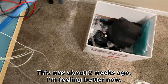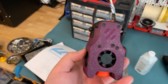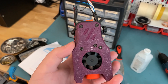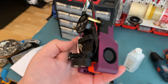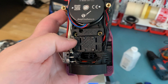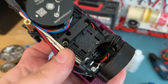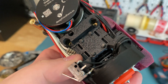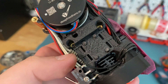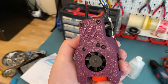I assembled the toolhead for the Micron. You can see the Voron logo here instead of the Micron logo — I'll get to why that is in a second. Here is the entire thing assembled, including the parts that let you mount it to the XY carriage. You can also see the belt tensioning mechanism and the screw holes for the MGN9C carriage — you just push the belt onto the carriage. That's the tensioning mechanism; we'll see how well it works.